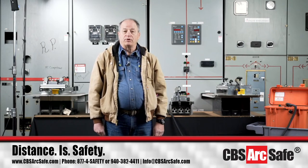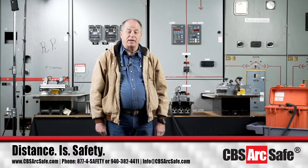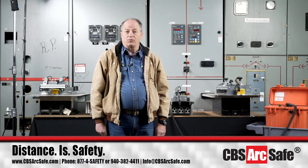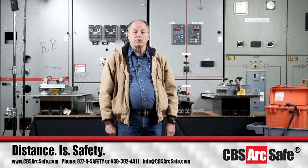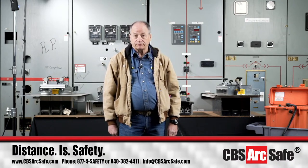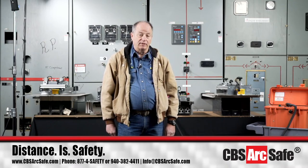The thing to understand when you're dealing with molded case circuit breakers is this. These can be mounted in a panel board, which is quite often how we see these things mounted. They can be mounted in an enclosure. And the thing that we need to know is, what are you putting your hand on to actuate these? The remote switch actuators we're going to show you today are the ones as if they are mounted in a panel board situation. If you have them in a motor control center, that will be a different style of actuator than this. What matters to us is what you're going to put your hand on.